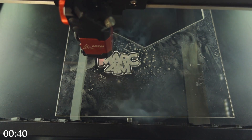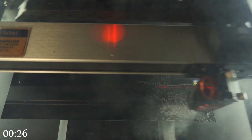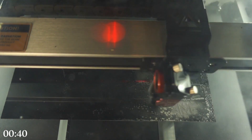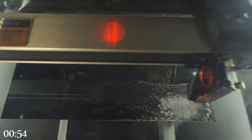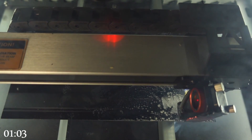That's a key ring made in less than a minute — about 40 seconds. Now we'll have a look at the colored acrylic — this is black acrylic. The engraving wasn't the best; I probably went too high power. Black acrylic absorbs more of the laser light, so I probably could have taken it down to about 10% power. I set the DPI a little higher on this — the clear acrylic was at 125 DPI and this was at 300 DPI — and it took about double the time with not much difference in quality.